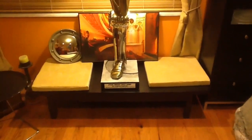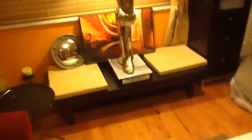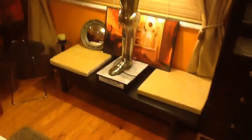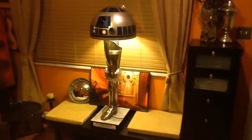This base is currently a temporary piece made out of foam core, reinforced with a little bit of resin on the inside. I like the shape — it looks pretty nice in person. I may keep it, or I might do a few different mock-ups with a slightly different design. Whichever one's my favorite, I'll mold it, and then the bases will be made out of fiberglass, along with some of the other parts.